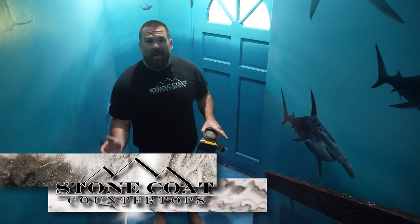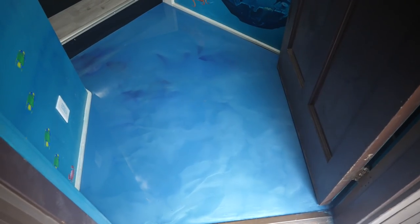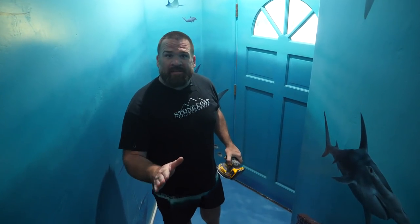It's the next day. Our flooring epoxy has laid out like glass — it looks fantastic. I'm going to sand the surface with 220 grit, clean it with isopropyl alcohol, and we're ready for the ultimate top coat.